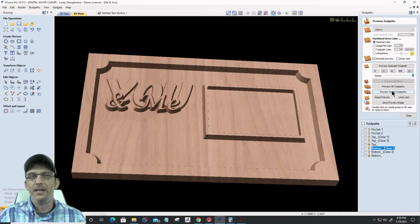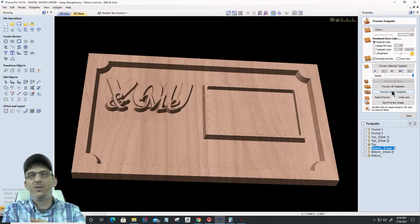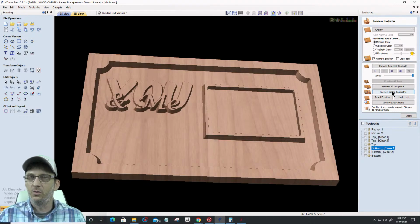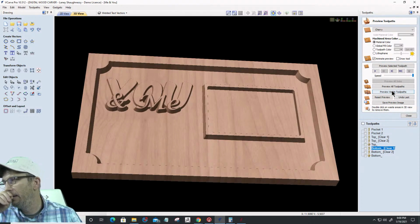I can do that. Or I can create that profile cut based on that design with a 0 cut depth, zero out my X and Y, run that G code, and see where it's going to be, to make sure I'm laid out right. Once I am, zero out the Z and run my regular toolpaths. Those are the only 2 ways I could think of if the software doesn't have a built-in frame feature, right? Okay.